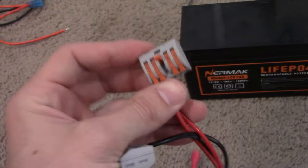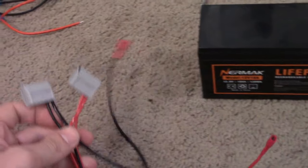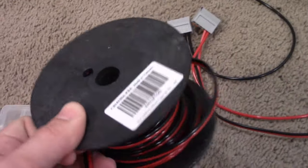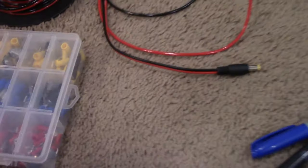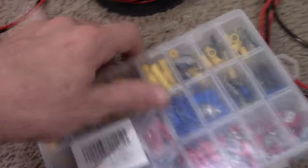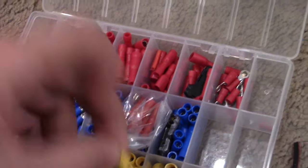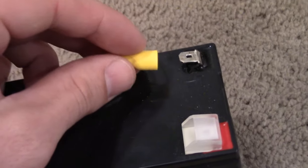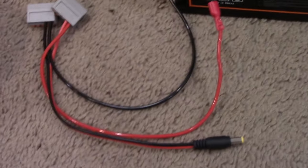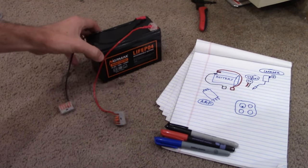I start by taking these little connectors and hooking them up to the battery so you can hook up several things easily. To do that, I get this spool of wire — 16-gauge — and cut off a piece, split it so you have your red and your black. Then take some standard connectors like these and attach them so they can slip onto the prongs on the battery. That's how to build the wire itself.